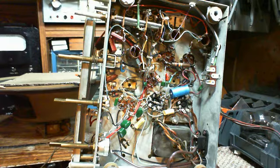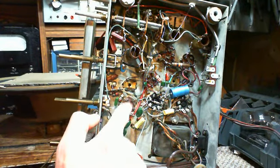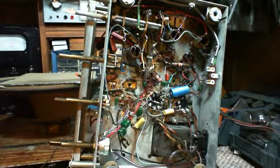We're going to start off by assuming the 6AT6 - which by the way I've swapped for a 6AV6, which is essentially an equivalent tube with the same pinout - is in the correct spot. We'll ignore that one for a moment and concentrate on these two sockets and ponder where they are in the circuit.